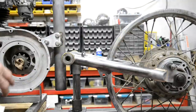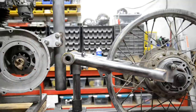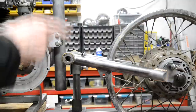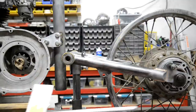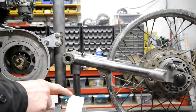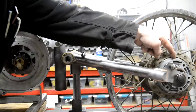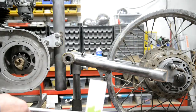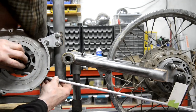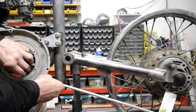I've worked out all the gear ratios. I always aim for 40 to 1 overall in first gear. So to get that, with the smaller crankshaft sprocket I can get, the smaller gearbox sprocket, I need 60 teeth on the rear. Okay. Now this 60 teeth is roughly 12 inch diameter. This is 3.5, and this is 2.5. So that's 6, so that's a 6-inch radius, that's a 12-inch diameter. So what we're going to do is we're going to put that there, and we're going to put that there. That's where it would be at rest, okay?